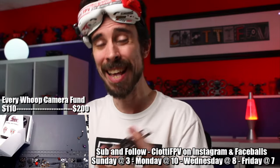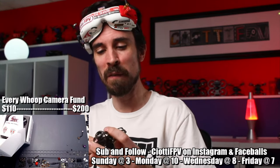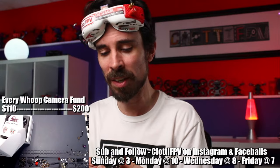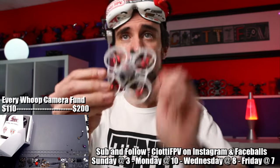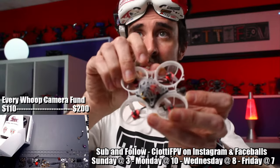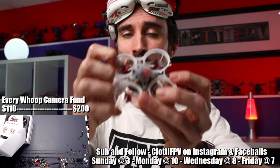Fresh battery. Let's see how it is. This thing flies great. Jesus. So I've got this combination of parts that I've figured out over the last God knows how many years of Tiny Whooping that I've now decided to call the ultimate freestyle Tiny Whoop. It's basically the old school Mobula 6. So it's this guy right here. It is the old school Mobula 6 AIO canopy and camera with a true RC Singularity antenna tucked inside the canopy. My favorite motors are the Tiny Whoop 0702 32,000s.